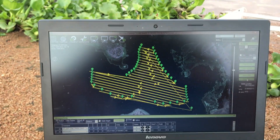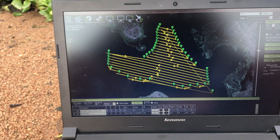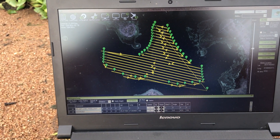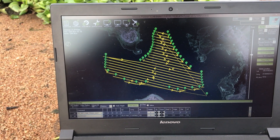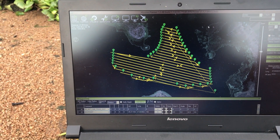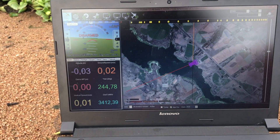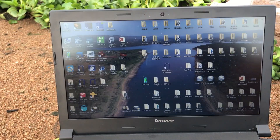That should be done. We say okay, then disconnect because everything's loaded — close that, go back to flight data, and shut that down. That's basically it — it then goes and does its thing. When it gets to the end of its set course, it goes into a loiter mode, which is just a little circle around and around at idle speed.